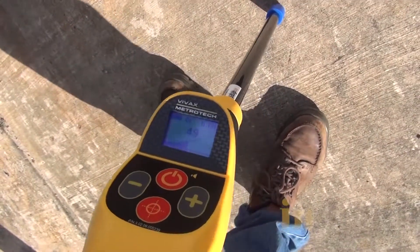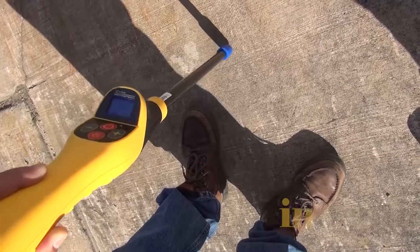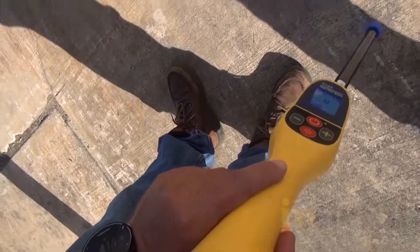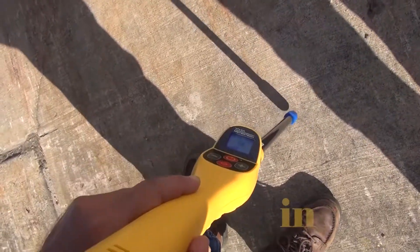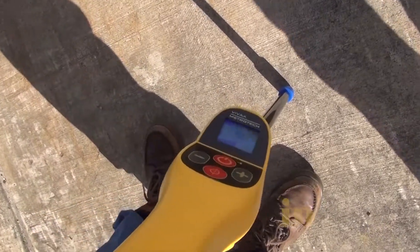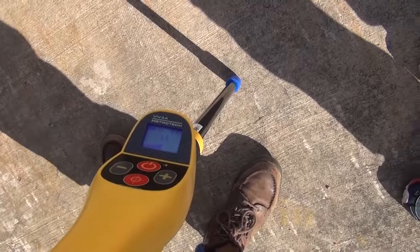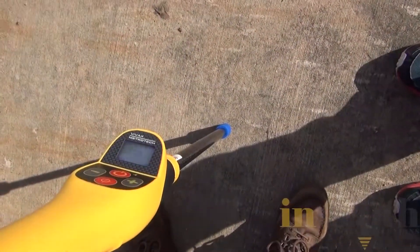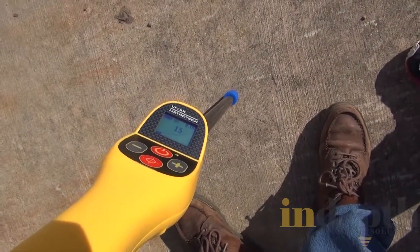It's semi-automated gain, so I'm going to hit the negative key one time and it should drop to about 50 percent. Now I can move and try to find the line again. The numbers are going down — I passed it, and it's at 50. So it's right in here. Going straight down, you notice the number built up a little because it got closer to the ground. Now I have the best locate. I'm going to rotate the receiver to find the direction it's going. As I rotate, the numbers are dropping and I'm looking for the lowest number.